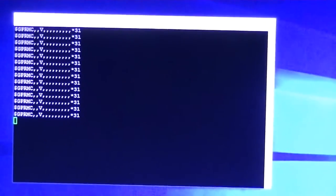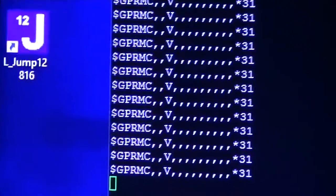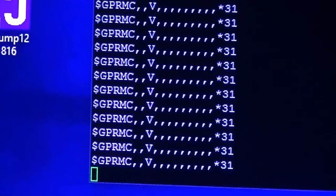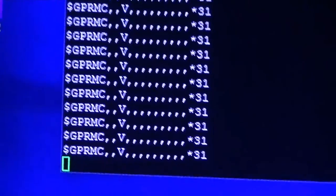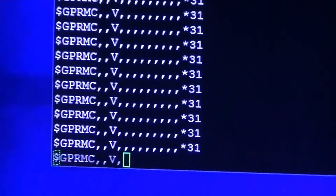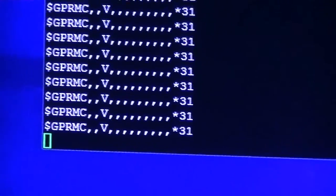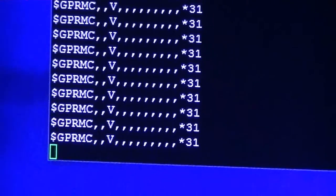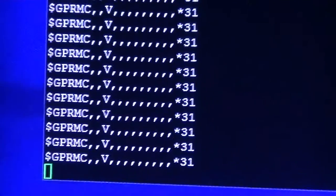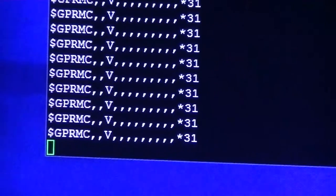I don't have lock yet, but you can see I actually have it configured to do just one particular NMEA sentence, the GPRMC NMEA sentence. And so it turns out, while that may be enough for the other device that I was working with, this is not enough information out of the GPS unit for Mission Planner to do follow me mode, and I'll show you in a second.